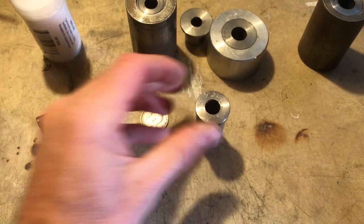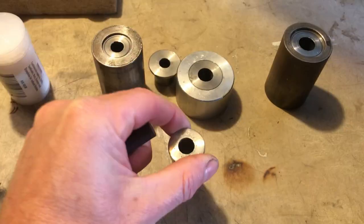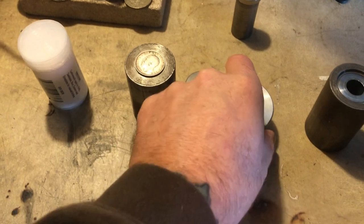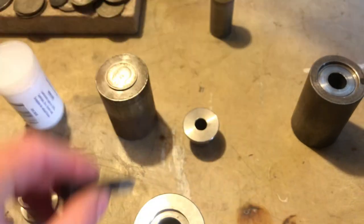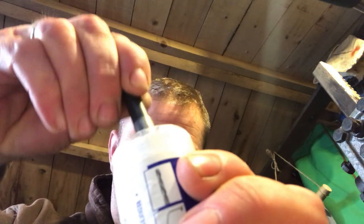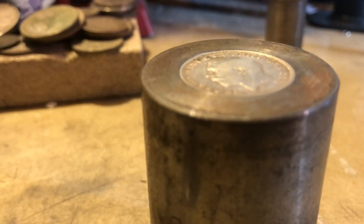You get all different sizes of dies — they go with the punch. Select the one that suits the punch, nice and tight. You put your coin into the die, then put the appropriate top piece in which fits the punch, and drop that onto the coin. Put your lube on and then get a hammer and smash that through. Just put the lube around the sharp edge of the punch.